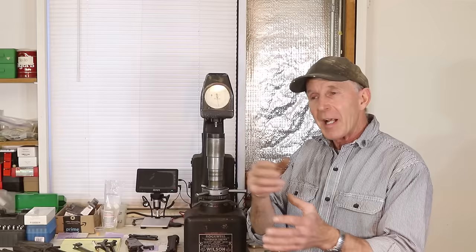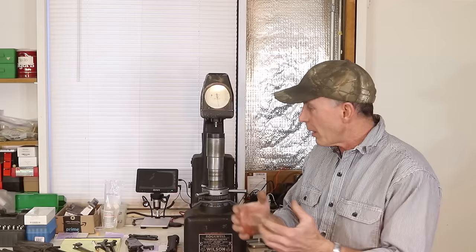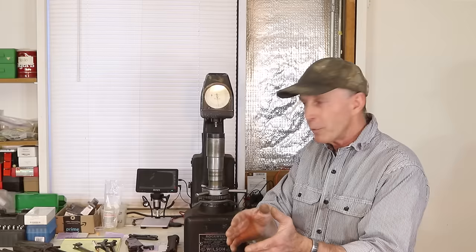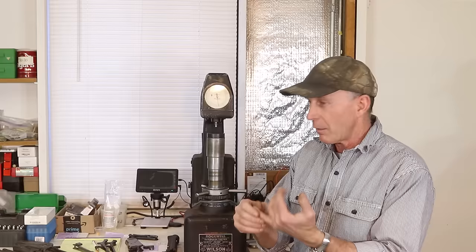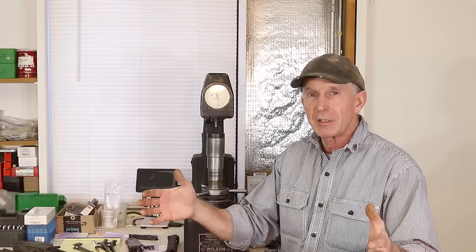We've got a first model 1873 here and we're going to test it. After serial number 42,000 in the 73s, they went to just a mild steel — similar to a 1018 mild steel used commonly today — and we saw a lot of the barrels we tested were that mild steel. Our expectation is that Winchester used that from about 1875, all the way up into the 1930s, when the Model 71 came out in '35 and the Model 70 bolt-action came out in '36. We expect those were a proof steel, similar to 4140, which is a common barrel-making steel today, but everything else in between was just mild steel. We're going to test out that theory today.